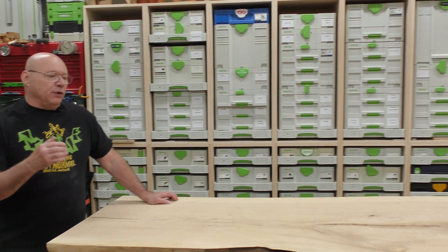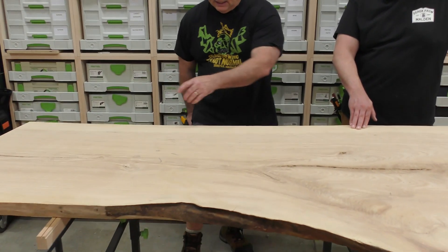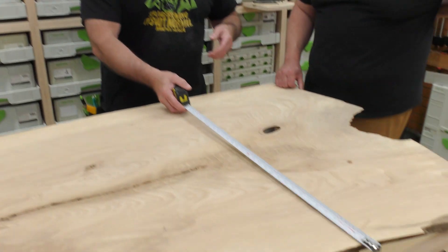Before you order a desk frame, you need to look at how much length you can get. This slab is 86 inches and the frame I have off to the side goes to 72, so we're good. I bought the Uplift commercial version — they have an I-beam on the commercial version, so I was worried about side-to-side stability. The depth is 35 inches and they rate it for 30 to 36, so we're fine. It's a C-frame with feet at about 27 and a half inches.